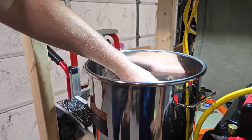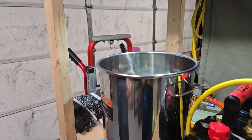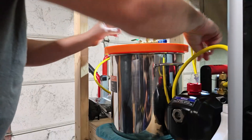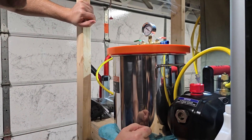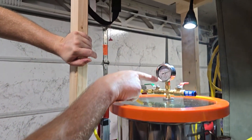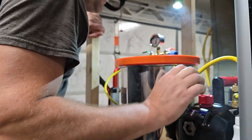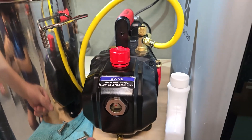I'm going to stick the aluminum down in the chamber first, remove my handle, and the wet PCB is going to go down in the chamber. We've got to button it up and activate the suction pump. This lid is like three-quarters inch thick glass — it is heavy. We'll close this, kick on our pump. This is a 6 CFM two-stage vacuum pump. This guy pulls a very nice vacuum. Maybe it doesn't get down to as deep a vacuum as I'd really like, but I'm working with what I've got.